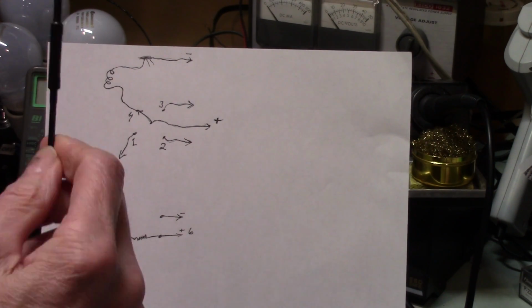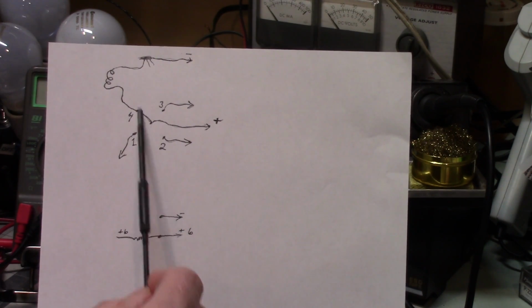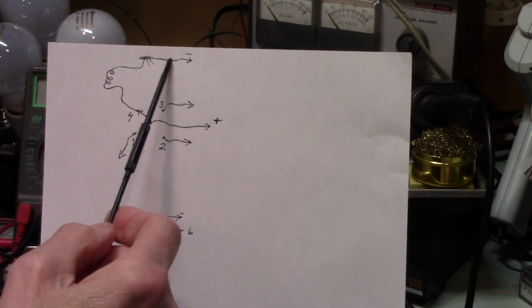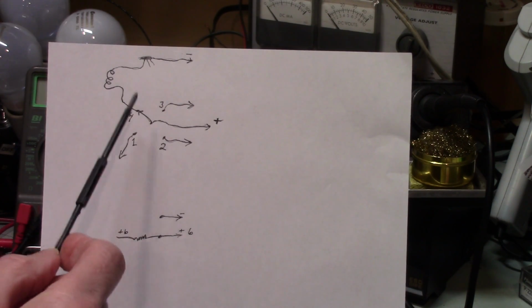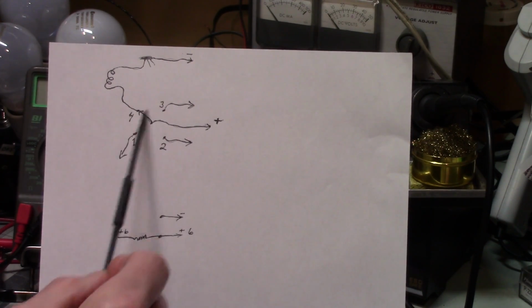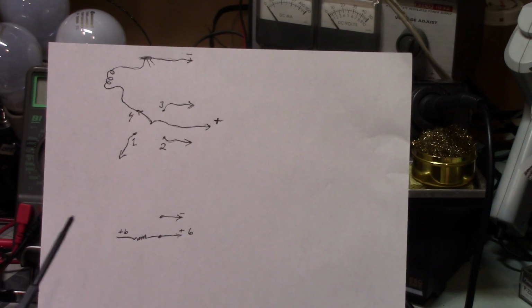So, because I was getting voltage, and it looked like the right voltage between here and here, I decided the bulb was dead. Now, I don't remember, because if you hit the switch so that it goes from here to here or here to here, there would be nothing else on this line, and if I had measured from here to here, it would have told me immediately that the bulb was fine. But what I did do is I unsoldered this wire from here, not being sure. Maybe there was something else funky going on in this switch, which I've run into before. So, I did find out that the light was indeed okay, because I didn't want to assume.